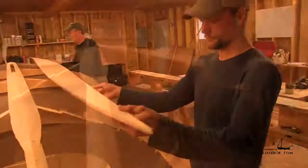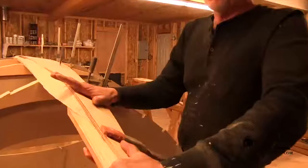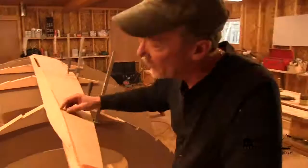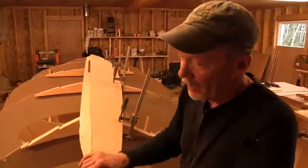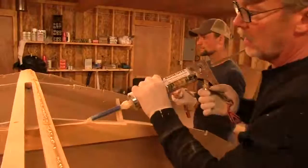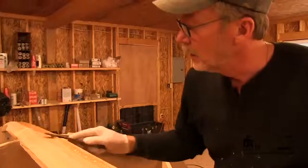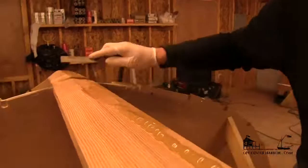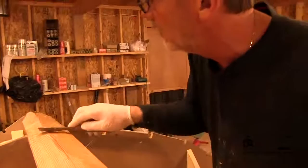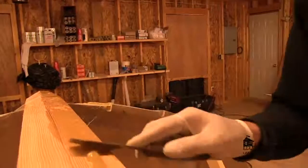Let's try that clamp — we've made our corrections and tunings and offered this back up. I am much happier with how the plank fits on the bevel of the joint between the keelson and the stem. This line is much fairer, fitting much better along the center line between the new bevel and refairing this edge. I'm going to spread our epoxy bead across the full surface of the keelson with a putty knife, making sure we've got epoxy on the full gluing surface so that it's sealed, and leaving a fat bead in the middle that will spread out as we clamp the thing down.